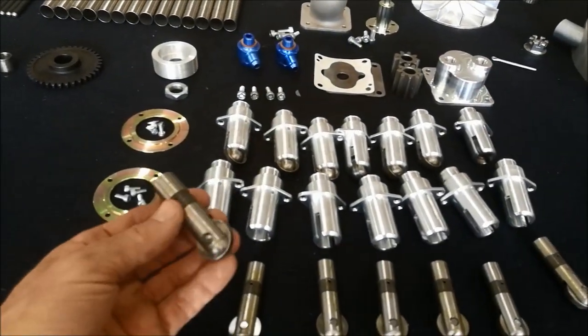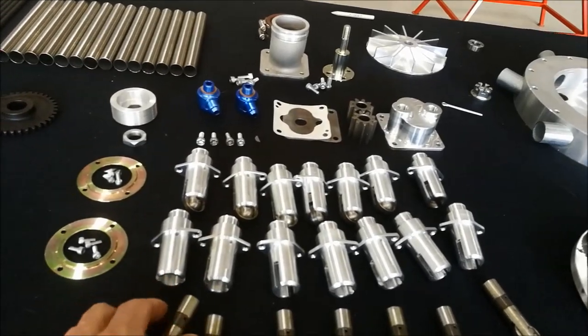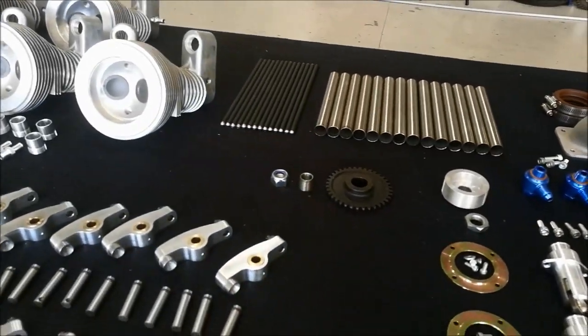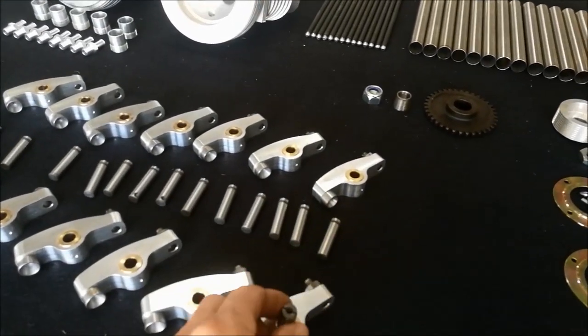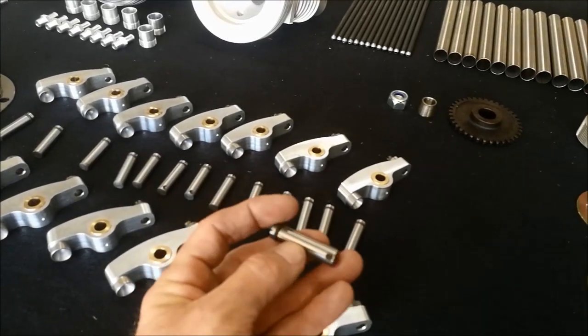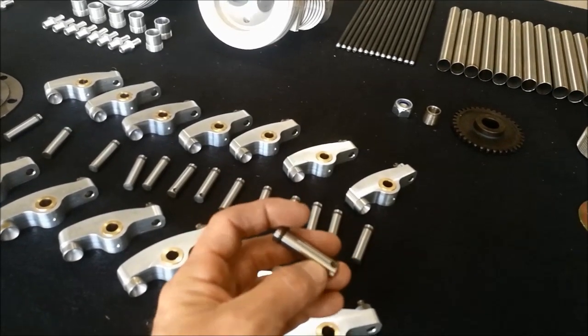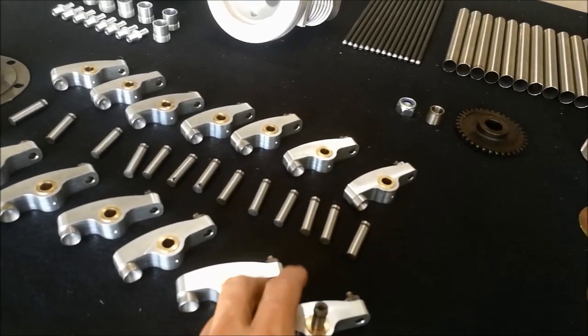The lifters are hardened roller lifters — hardened and ground with deep cups. We've got a starter motor input, pushrods and pushrod tubes, and rocker arms with plain bearings and an O-ring seal at one end. The other end is blind with a keeper grub screw with a point on it, which is trapped by the rocker cover. That's been working quite well.